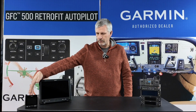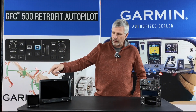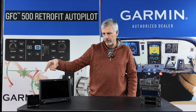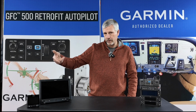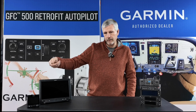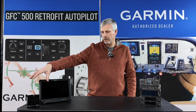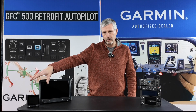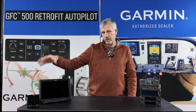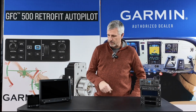And this guy, in addition to an attitude indicator, it has a 4-hour battery attached to it, and it will also display airspeed, altimeter, vertical speed, turn and slip, ground speed. It can be programmed for the aircraft's V speeds, and so there can be some altitude alerting, although we'll have an autopilot interface, which will probably be more functional. So it is still a very powerful instrument, and in an aircraft, dual G5s, VFR or IFR, is still a very, very good upgrade to the aircraft. So, good instruments.